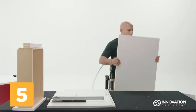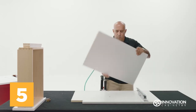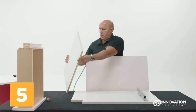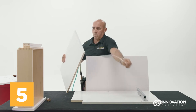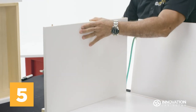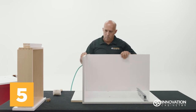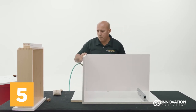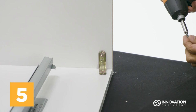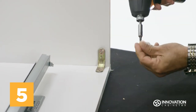Once finished, remove one of the base sides and position the second base side on your workstation, slotted edge closest to you and notched corner to the upper right. Retrieve the base backing and bottom, ensure any protective tape has been removed, and fix the base bottom to the far right end of the side with the pre-placed wooden pegs and pre-drilled holes. Gently tap into place with a rubber mallet. Next, slide the base backing into the side slot and push it flush with the bottom, then secure where the bottom and backing meet with a nail gun. Place a corner bracket where the tops of the backing and the side meet, then secure in place with a drill and drywall screws.